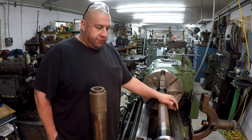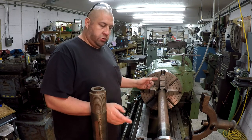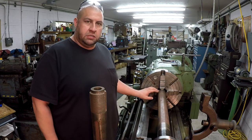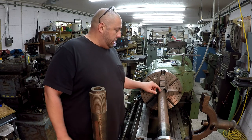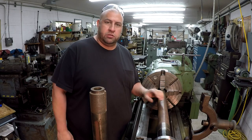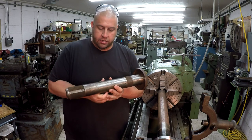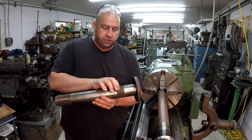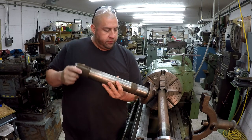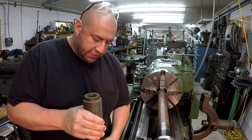It's time to get started back on this shaft. We got our flange side finished on the outer side, so we're going to go ahead and flop ends on this and start getting it all finished in. We're going to have to do some facing to get it to the right length and some turning to get it down. It's already very close, so it's basically going to be finished machining.